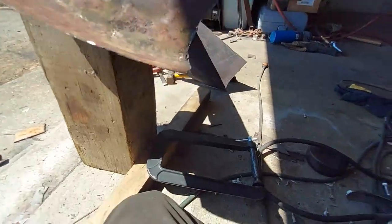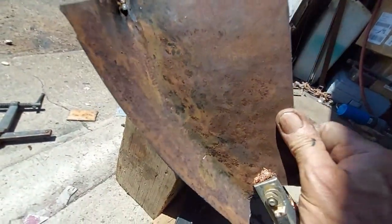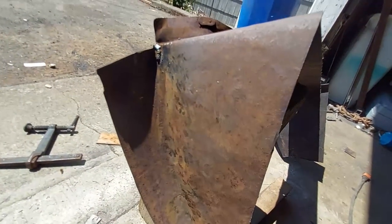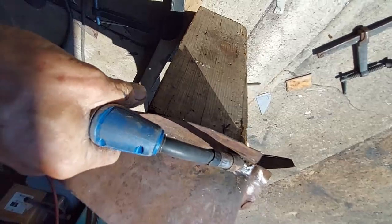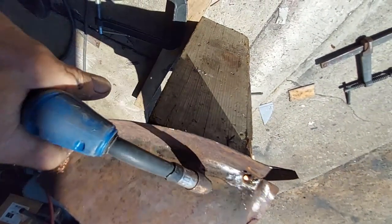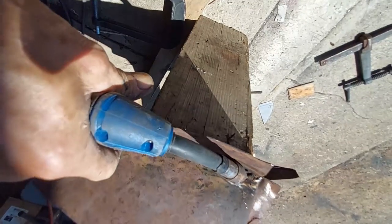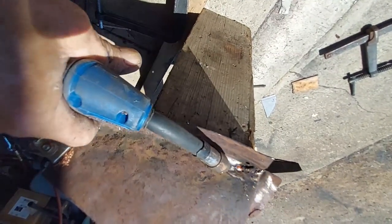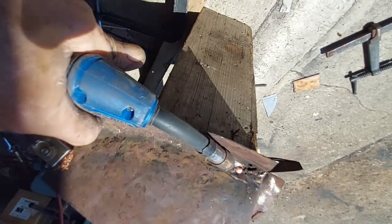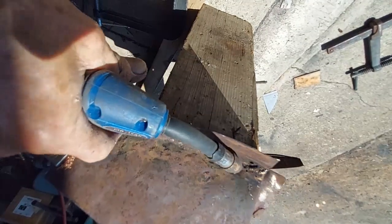Let's see what we got here. The hard one is just balanced. I'm gonna clean this up a little better with that wire brush first. There we go — I can see my crack better. Now I'm just gonna spot, spot, spot. I'm putting about half of the bead on top of the last one and working a little bit side to side. So there's that one welded up on this side.